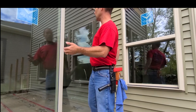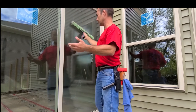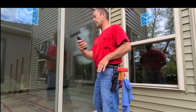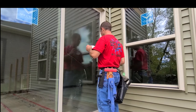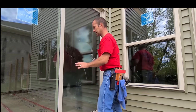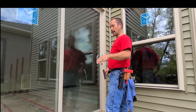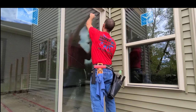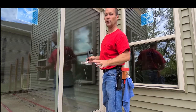When we use razor blades on glass, it's a tool all window cleaners use and should use — you just have to be aware of what type of glass you're using it on. We always use scrapers first to help remove stickers, check for concrete splatter, and address silicone around the edges. This is a patio door — both sides are tempered, as they always are here. But we never use scrapers on the full width of any tempered window.